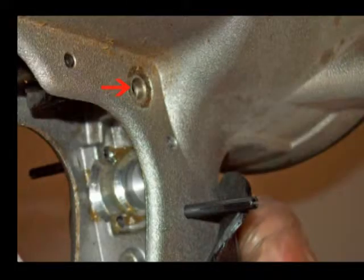The red arrow shows the trigger retaining pin hole. This pin can go in either way — it makes no difference. There are two roll pins that must be driven from the main body in order to remove the trigger air control valve. I have already removed that control valve, and you can see the hole where it goes between the two roll pins.